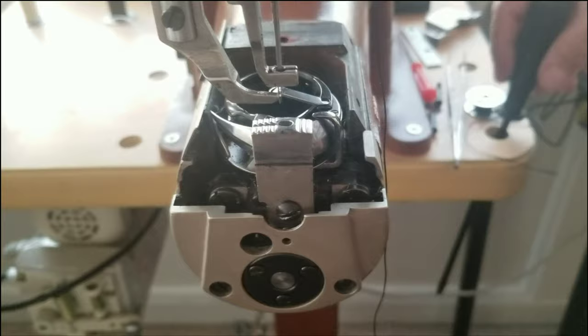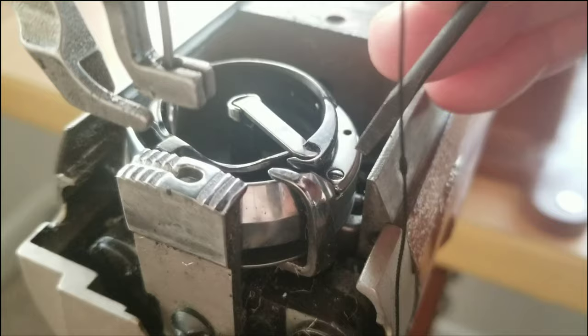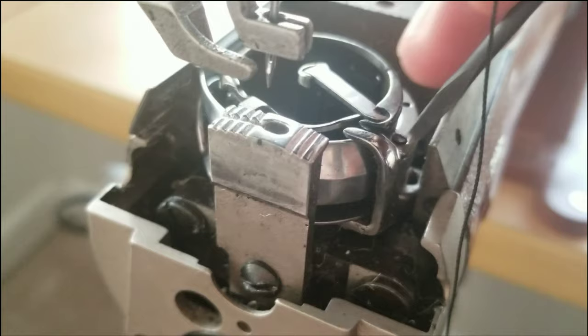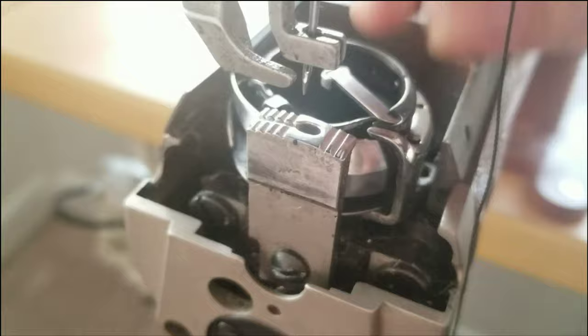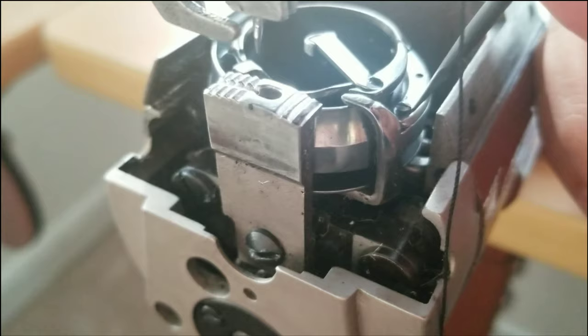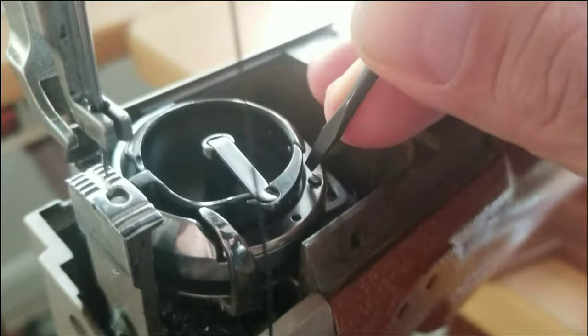What we need to do is get to the gib and remove the little screws. You should stuff a paper towel down in there so those little screws don't fall down. With your machine being fouled, you won't have the luxury of being able to rotate it around to get all the parts to the best place, so you're going to have to get the little screws out even if you can't reach well.